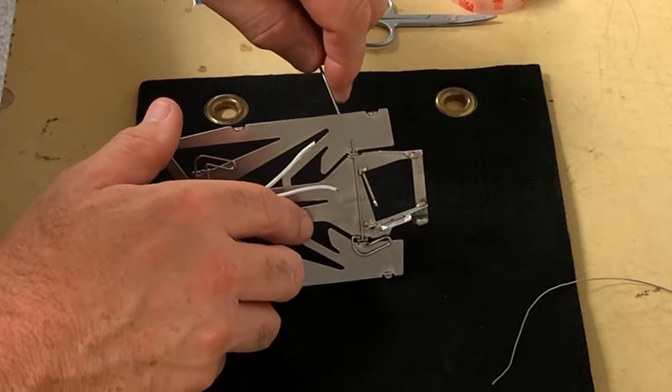So next we're going to peel the backing off of the double-sided tape, like so. And we're going to stick the positive and negative terminals all the way to the front. So I pick up the wires right here and stick them up. And it just so happens this chassis is the perfect size to lay this ESC in. Give it just a little firm push right here, and you can see the chassis still retains all of its movement with no contact.